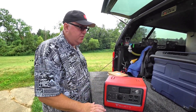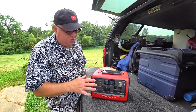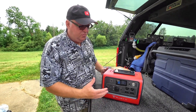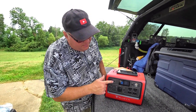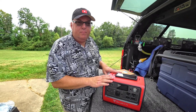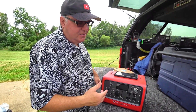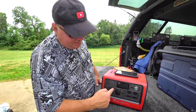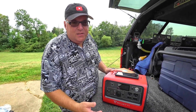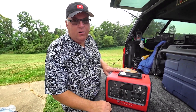One important thing I forgot — there's a 15-watt wireless charger on top. Just throw your phone on top, no cable needed. You can use basically all the ports at the same time; just watch how much power you're drawing. With a 200-watt max solar panel, this has a built-in MPPT charge controller. So as long as what you're drawing is less than 200 watts, you're still charging the battery and getting power direct from solar — a brilliant design.